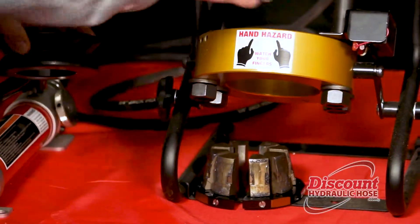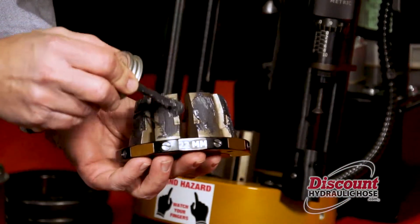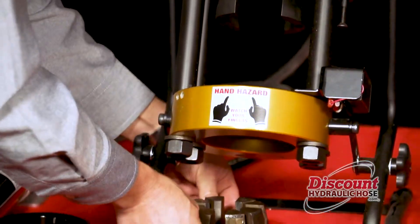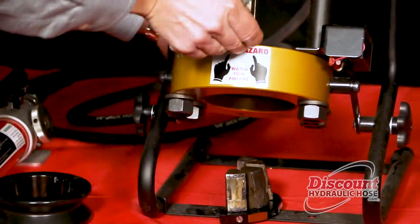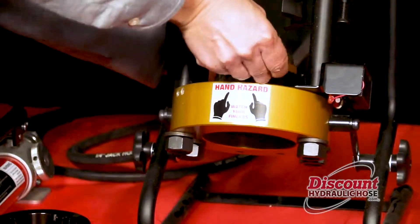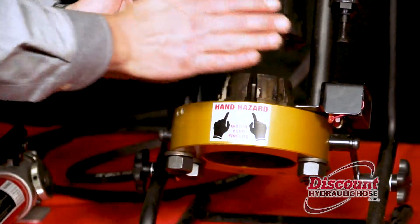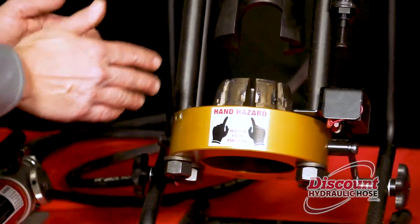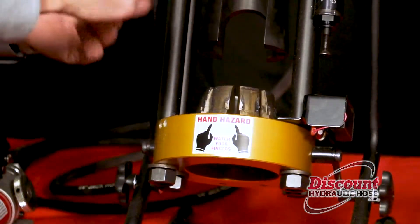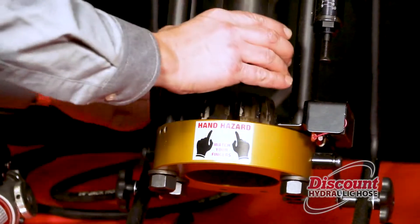You've got a bottom plate. You want to lubricate the exterior of the teeth of the die, then insert your die on top of the bottom plate. What's most important when inserting the die is that you've got two half moons, one on the left and one on the right, not the top and the bottom. The reason for that is because of the angle of the machine it's possible for the die to tilt backwards, which will then potentially damage the die. Then you're going to put your plate on top.